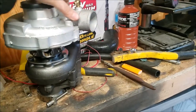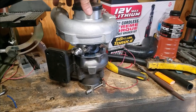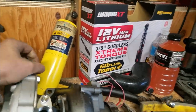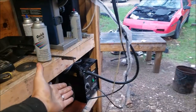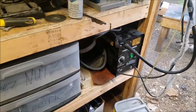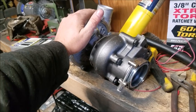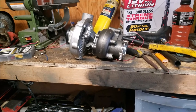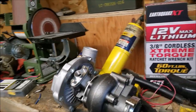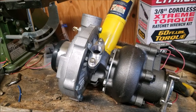Now let's get this back on the turbo — and done, just like that. We now have a turbo that is able to be externally wastegated. That's pretty much all it takes. Not everyone has a welder or the ability to weld, but if I can do it with a hundred-dollar Harbor Freight welder, welding is probably the best skill to have. Like, comment, subscribe — and I think this is a pretty legit solution since it's been done before. See you guys in the next one.